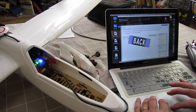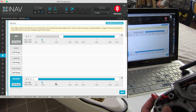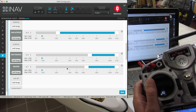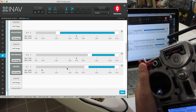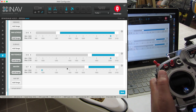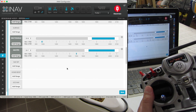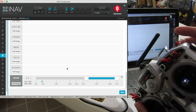Now we're connected, let's go to the modes tab. Air mode is always active — we don't want it to disarm when gliding. On channel 5 (SA switch) we have the arm switch throttle active. On the SA switch we have altitude hold nav alt hold, and in the down position we have loiter mode which adds position hold, so it holds altitude and position and will loiter around the spot where I turn the switch on. Channel 7 has manual mode (pass-through) and return to launch on the down position, and finally the failsafe test switch.